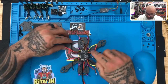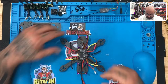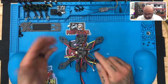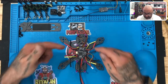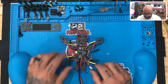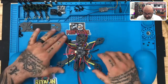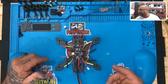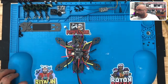To review: make sure the front of your frame is facing away from you, the back is towards you, and the arrow is facing away from you. Your USB port should be on your left and the receiver wires on your right. Motor wires should be yellow, red, black from the outside in — repeated on the back side. Once you reach this point, the next thing we're going to do is mount the motors and plug them in, so we'll see you in the next part.